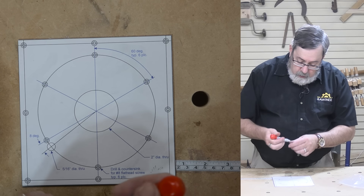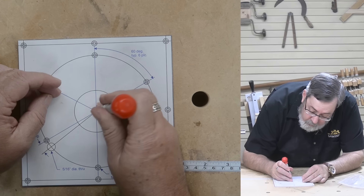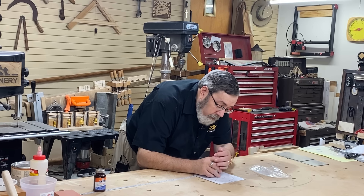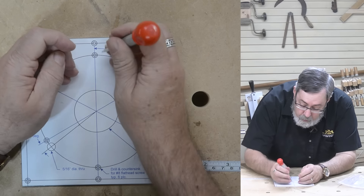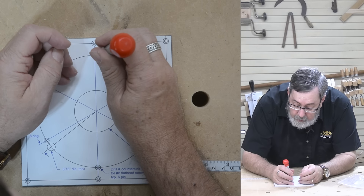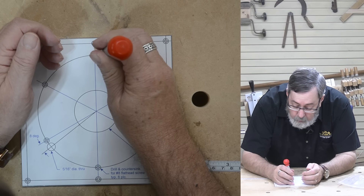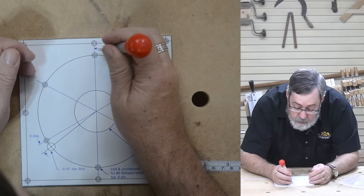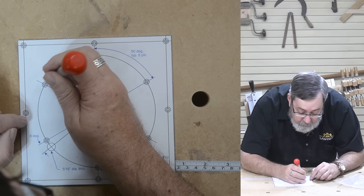The aluminum insert plate needs to be cut. You can't necessarily get a piece of aluminum the size you want. My table saw was advertised as being able to cut aluminum, and in fact it will. You could probably do this with any table saw, as long as you've got a carbide tip blade. You want to cut a little slow going through aluminum, slower than wood, but it will cut through it fine.